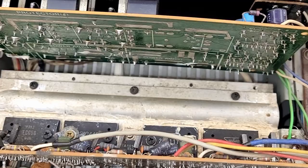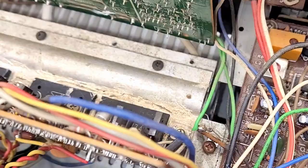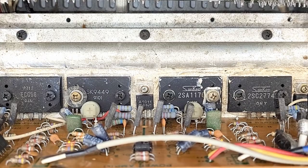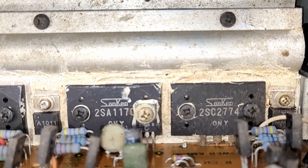This is one thing I do not like - Panasonic used these, and this looks exactly like the ones Panasonic used. It's actually a tube with some kind of refrigerant in it so it conducts heat very effectively. But these things would spring a little leak where it's been swedged and welded, and then it would just be a hollow copper pipe and would not exchange any heat from the transistors into the fins. I'm not sure if it's R12, R134, or some kind of ammonia.